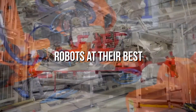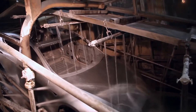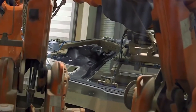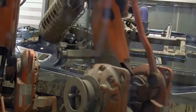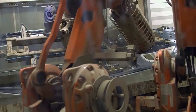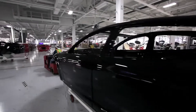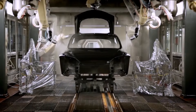The third stage is completely driven by a robotic arm. Since it involves tilting the body and dipping it in a tank, any human involvement becomes difficult. Even with robotic arms, the time consumed is approximately seven to eight minutes. In a process where every stage is time bound, a single minute matters a lot. Hence, the involvement of manual labor is avoided at this stage. The tank spreads a coating of sealant over the entire skeleton, which officially initiates the painting job. The process of painting is divided into four parts. The current activity of dipping it in a tank is the first part, followed by the second, where the coating is dried with the help of a vacuum.